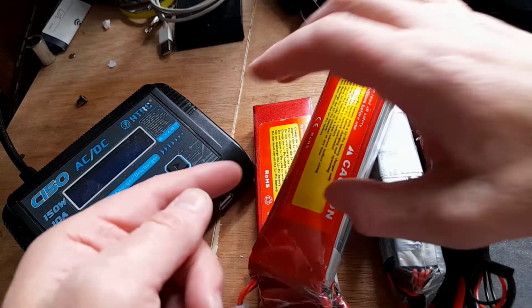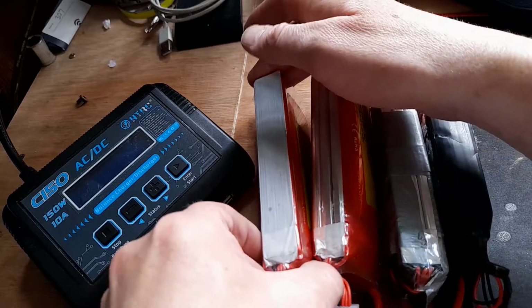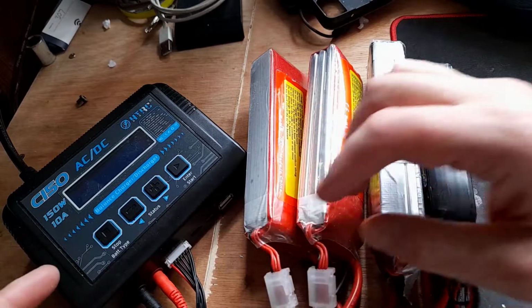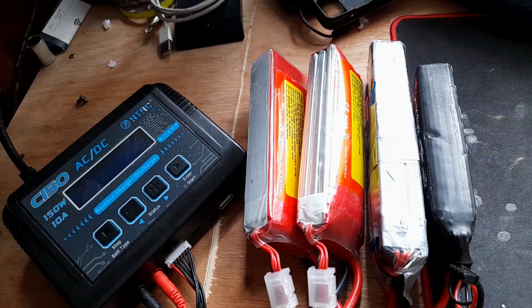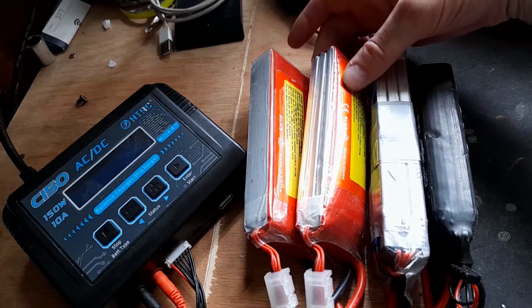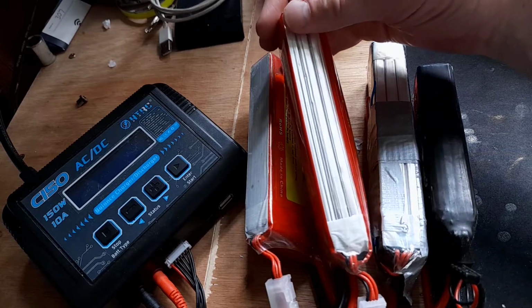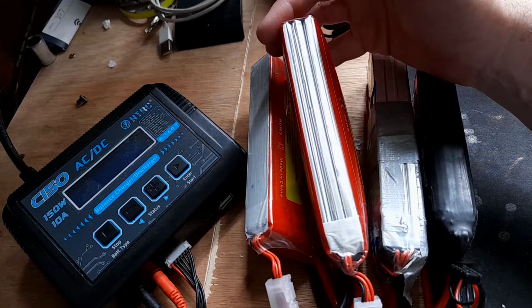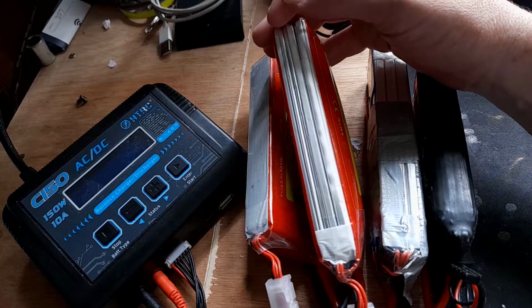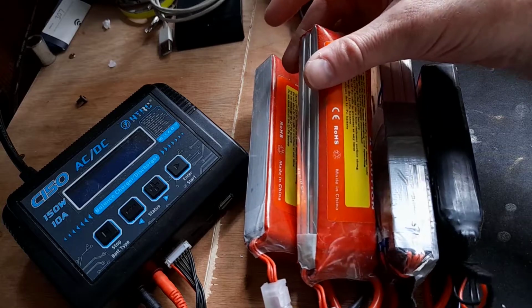Generally, each one of these cells will be about the same voltage when you put it on the analyzer. When you put it on the charger, it charges the whole battery and checks that each cell is more or less balanced with the rest, so you get an even discharge rate. Once they start to fail, with any physical or chemical damage, the battery is basically not so useful, and the capacity will be vastly diminished, so it's not worth having on board. So with this in mind, let's have a look and see what the voltage is like.